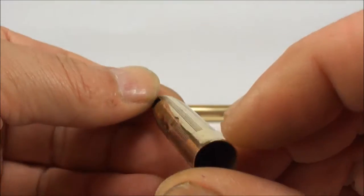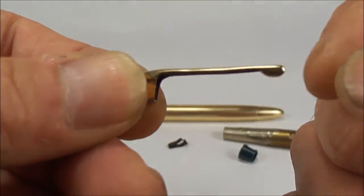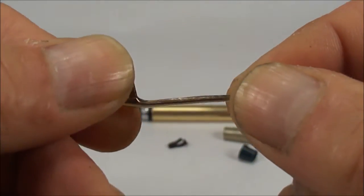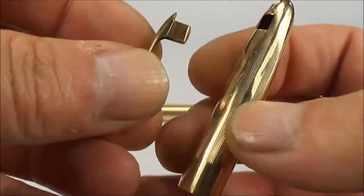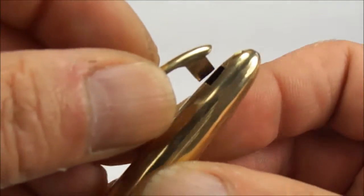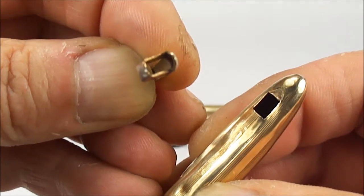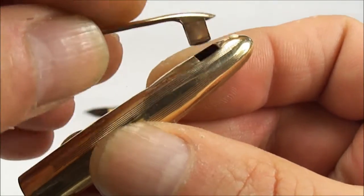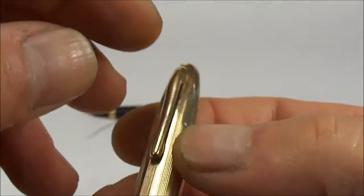So that when we send it back it's hopefully in a better state. Also, if you look at the clip there, that's badly bent as well. We need to bend that out slightly and work on the clip as well. And just to show you how it actually goes together — obviously the inner cap goes inside, and the clip just simply — let's show you the inside of the clip there. There's a spring that sits inside the clip, and what happens is the clip goes back inside the cap.